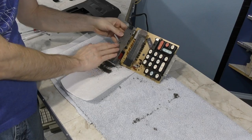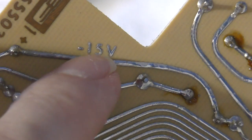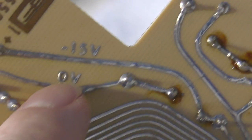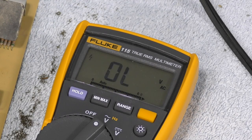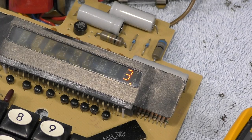The next thing I wanted to do was turn this thing back on and poke around with my multimeter and check the voltages. One nice thing is they've labeled a lot of stuff on the bottom of the board, including several different voltages that are expected to be present. Poking around, I did manage to find voltages pretty close to the numbers stated. So I wasn't entirely sure why it wasn't working — but then for no explainable reason, I eventually noticed the calculator came to life.